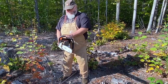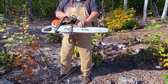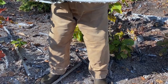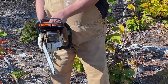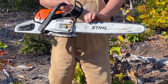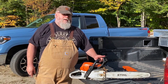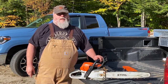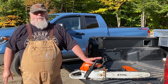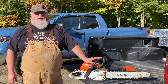That probably didn't look too dramatic, but it set the chain brake. I'll do that one more time — chain brake is off, 18 inches or so off the end of the stump, let go with the left hand and let it fall. As you can see, it's locked up tight. If you do that two or three times and the chain brake doesn't engage at least once, you should take it into a shop and have someone look at it, adjust it, or replace whatever parts are worn out — it could just be dirty and need cleaning. That is the correct way to test your chain brake.